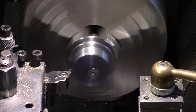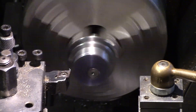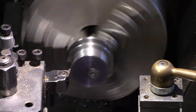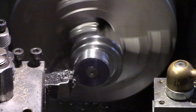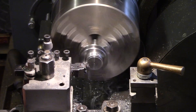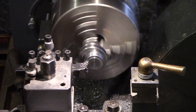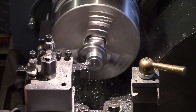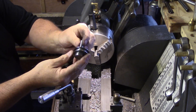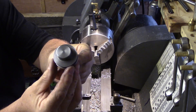The boss of the eccentric could now be turned away to become concentric with the axle bore. This was then faced to a final dimension and then released from the mandrel using heat to break the chemical bond.